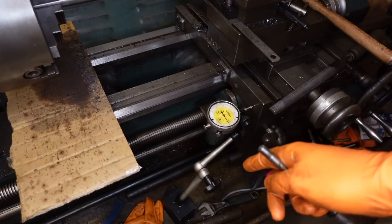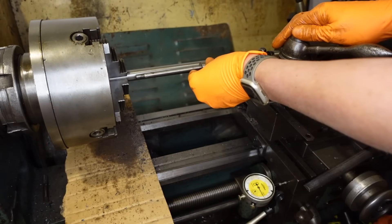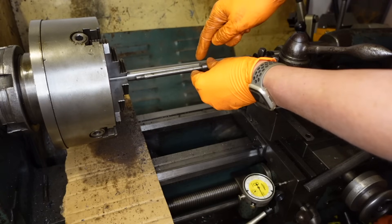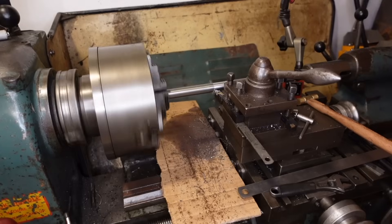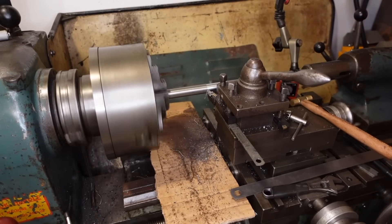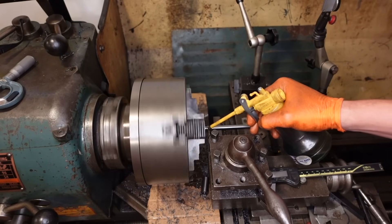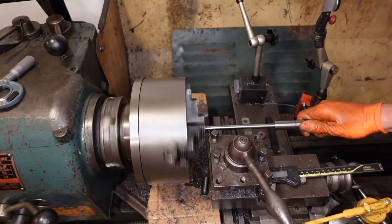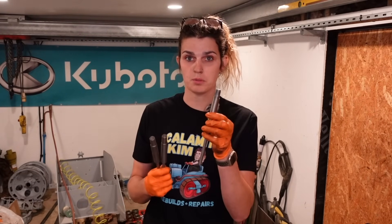I set up a stop here so I'm just going to go to zero every time on that. Because I centre drilled it, there's more than enough room. So I can do one final cleanup and then come back and do this side and run it up to make the width. So I just parted off the final shaft. I'm going to have to call an end to this video because my die broke — obviously self-assembly required now. I did however manage to get the two shafts made. I did make the third one but that's when it broke, so I need to get some more tooling next week and then I can finish these off.